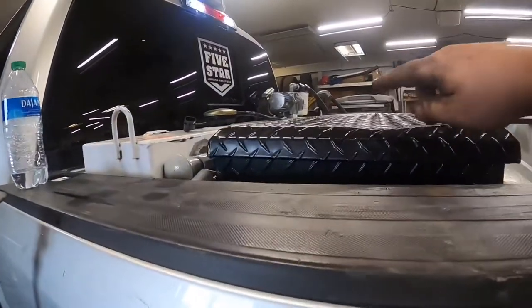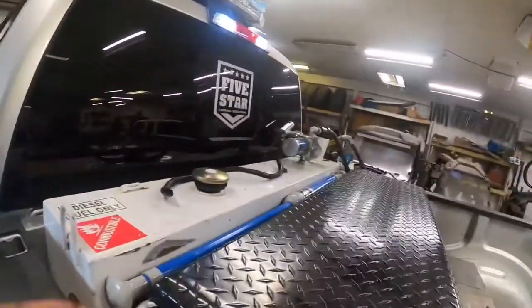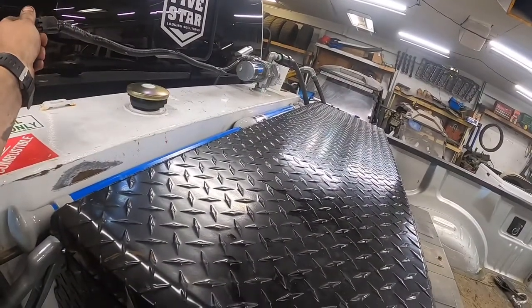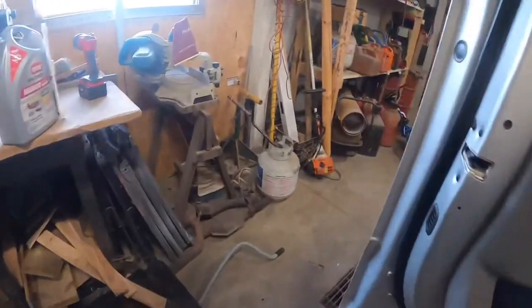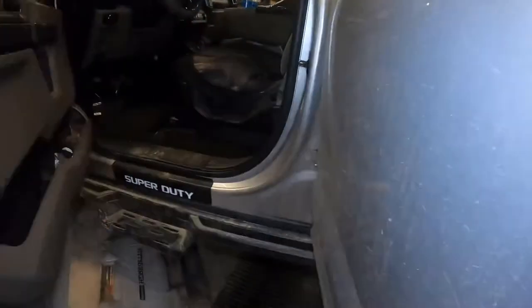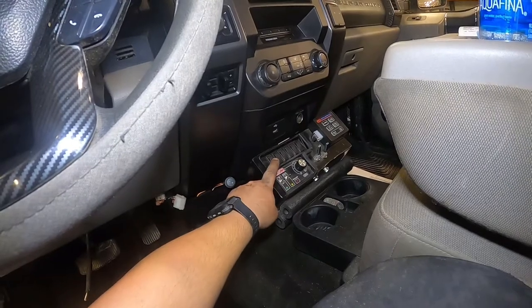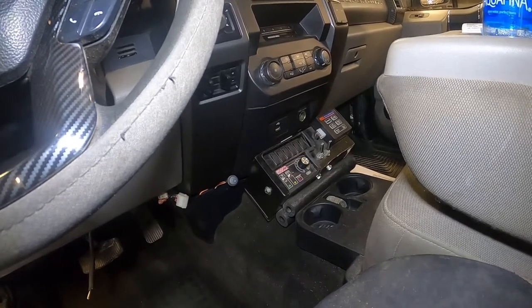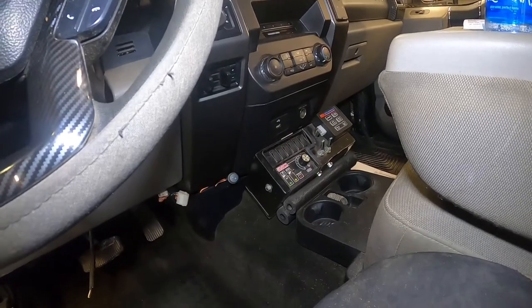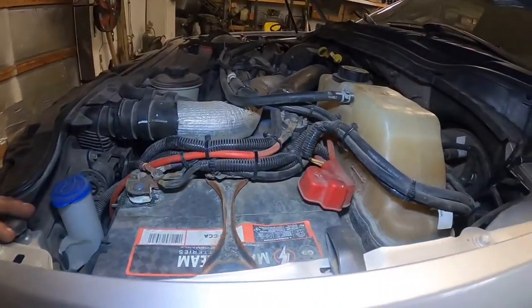Oh, also, if anybody wants to complain, there are 3 fuses on this pump. So you can see up there my extension right here. You see the little fuse end about half, a little over halfway down. So there's a fuse on it right there. Each one of these switches has a 15 amp fuse, plus they're backed up with another inline fuse for whatever it's powering. And there's the wire that I cut for the thing, and then this is kind of the wiring mess.